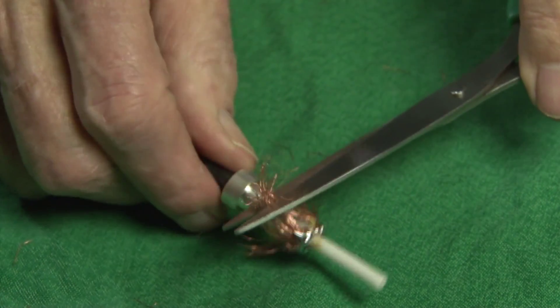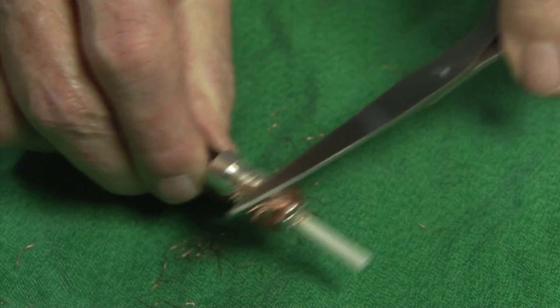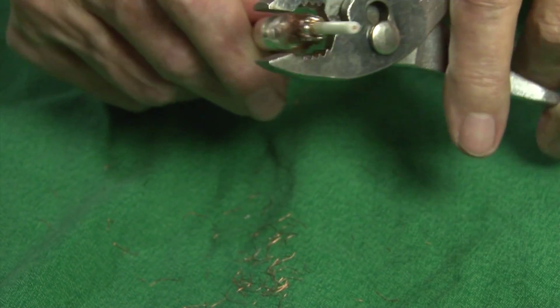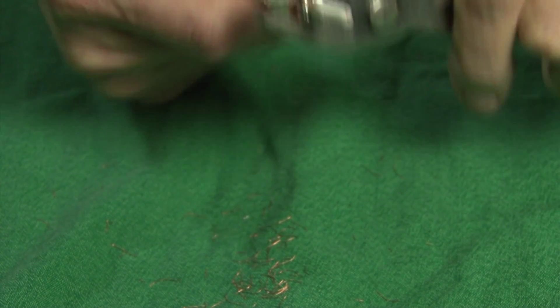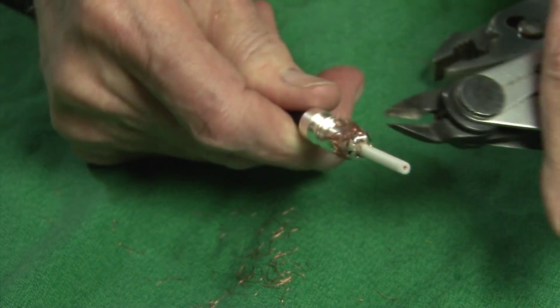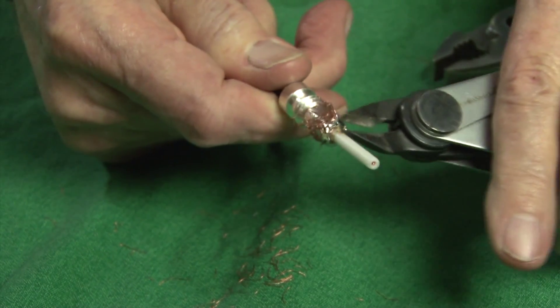The height of the edge should be built up about 30 to 50 thousandths of an inch. Then trim the excess wire so it is clear of the threads. If solder has built up on the sides excessively so it makes insertion into the connector difficult, just squash it down around the sides with your pliers or trim off the excess with a pair of dikes.